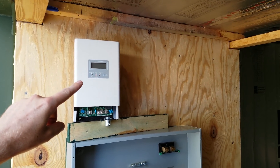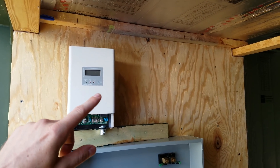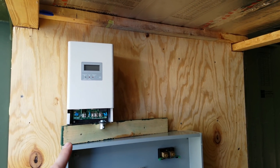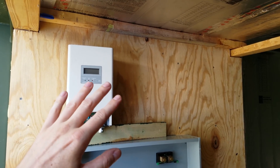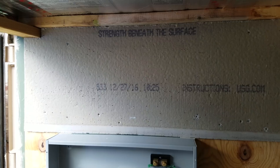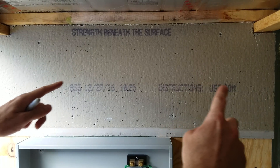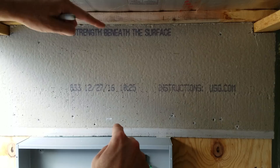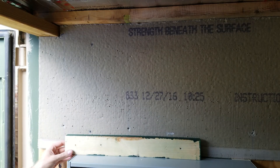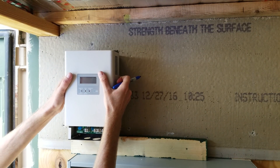Before we can get these controllers up, the manufacturer suggests mounting them on a non-combustible surface. So I'm going to cut a piece of cement board to fit the entire square above the control panel, which is where I'll be mounting three to four PCM60x controllers. I'm going to use this quarter-inch cement board. It's a pretty cool substance but a pain to cut. What I ended up with is a four-foot wide by 18-inch high piece with a notch cut in both corners. This board will act as a spacer between my charge controller and my metal enclosure.